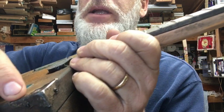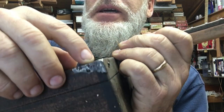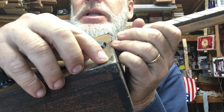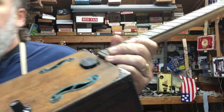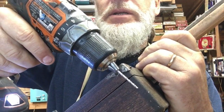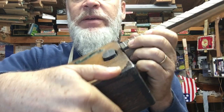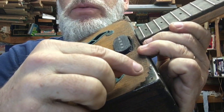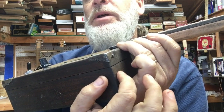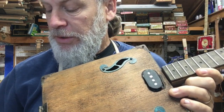The other thing I wanted to point out here is these patina corners, and I left this one, there's no screw here. Actually, a couple of things, but I want to talk about this one first. I did pilot holes in here with the long drill bit, because I wanted it to go all the way through into this wood down below. I've had experiences where if you don't pilot these, then these little joints right here kind of explode. So make sure that you pilot before you drill.